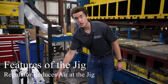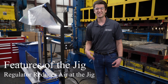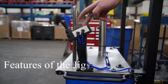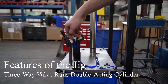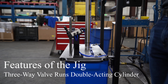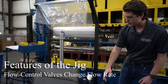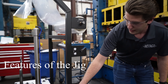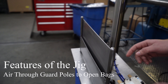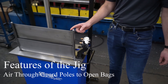The pneumatic system starts on the back side with the regulator. Shop air comes in at 120 PSI, and the regulator brings it down to 60–80 PSI for our application. From the regulator it's split two ways: in one direction it goes up through the handle and hits our three-way valve, which splits it to two directions for the double-acting cylinder, putting force in both directions. Flow control valves on both ends of that cylinder let you control the speed without adjusting the regulator. On the other end, air runs down through the bottom plate to fixtures on the guard poles, which run air up through the poles to open the bag further and keep it from sticking.